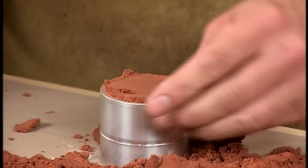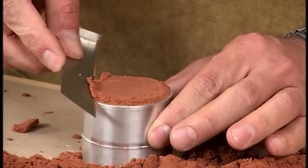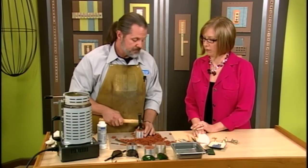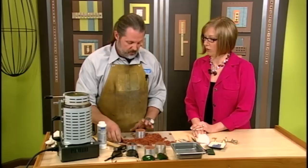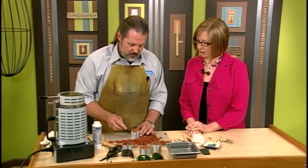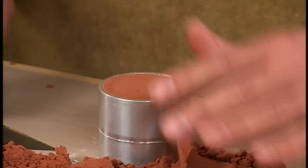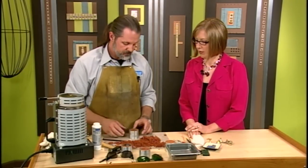That's probably about maybe half of what I would do — I would add more sand and keep tamping it until it just won't pack anymore. For the purposes of our demonstration, we'll just call it good because that would take a couple more minutes. Then you're going to shave off your excess. So now we go on the next step: cutting the vents in the pour channel.